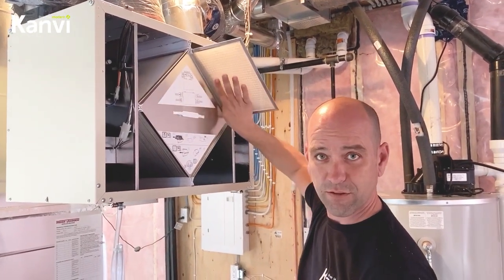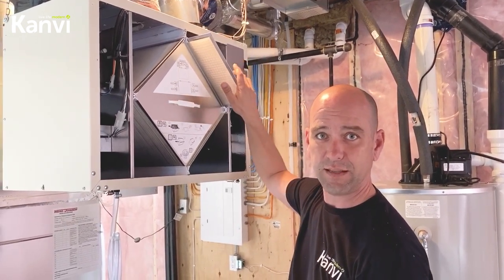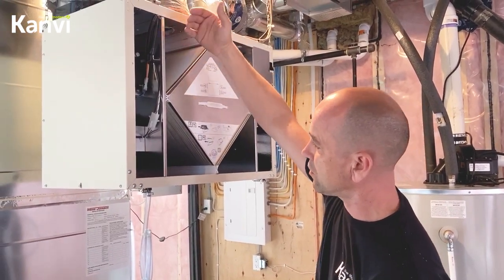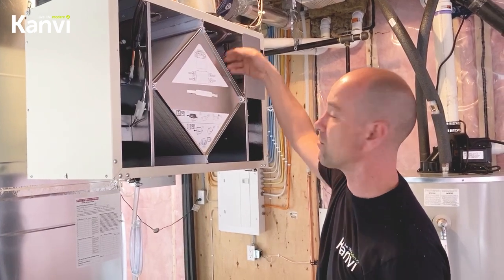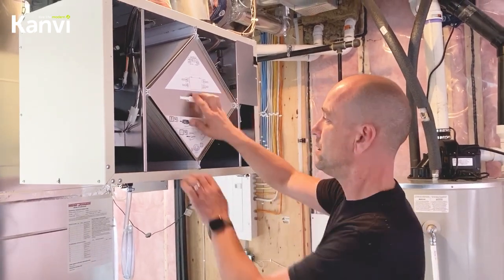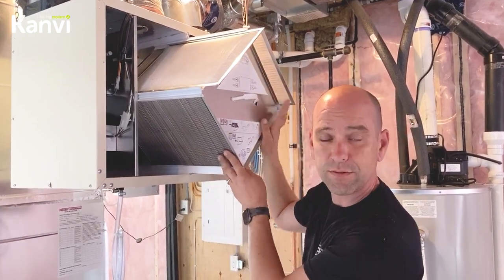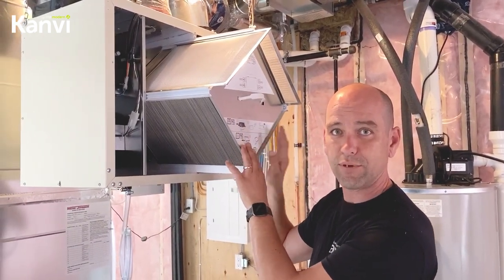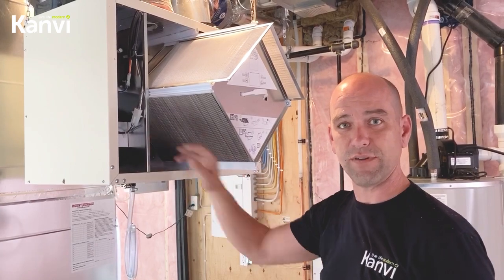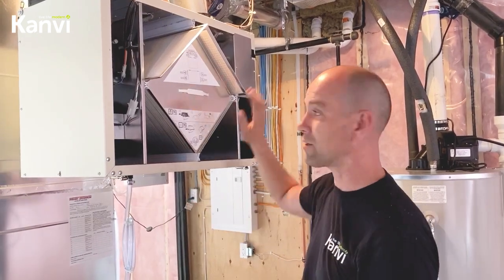If this filter is dirty, this is the filter from inside your home — the air that's inside your home goes through here. If this is dusty, that probably means it's a good time to get your furnace cleaned. The cold air from outside comes in through one side of these metal sleeves, and the air from inside comes through the other side — you use your warm air to heat up the new air before you expel it. To clean, you simply pull them out, set them inside a bathtub, shake them around a little with warm water, and put them back into place. While it's out, it's not a bad idea to wipe down inside here to remove any dust. Everything can come back in and drip dry right in place because it's got a drain.